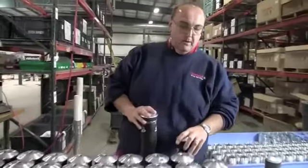The crimping machine wedges the crimp ring on so nothing comes apart. To test how good that crimp is, we take it over to the pressure testing machine, and one out of every hundred that we build, we burst — we blow it up until it busts. It usually takes between six and seven hundred psi to do that.